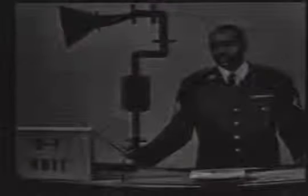Here is a mock-up of the particular section of the system we are interested in. Now because of the position of the RT unit, the waveguide is coming out the side in a horizontal position. The antenna is located above the RT unit, so we have to change direction and go in a vertical direction. We can do this just like a plumber would do it — we can use an elbow or a 90-degree bend.